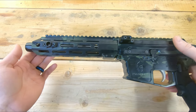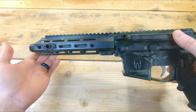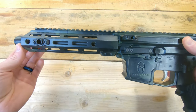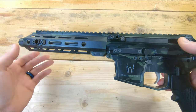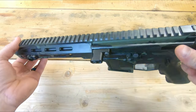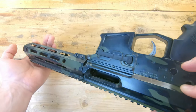The only other thing I did, the lighting down here I think is showing it a little more glossy than it ended up being, but as I said earlier, when we were spraying that clear coat you saw in the video, I wasn't happy with how shiny it was. So I actually took a red Scotch-Brite and very lightly just came through and I scuffed this clear coat up just to take a lot of the sheen off of it. It's still a little shinier. I wish it was a bit flatter than this.